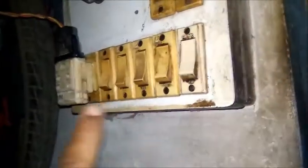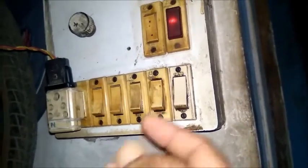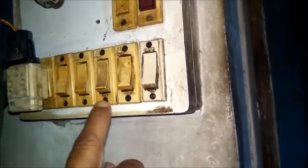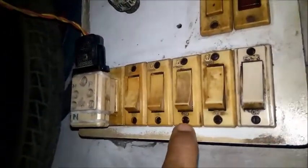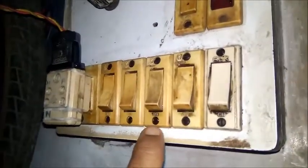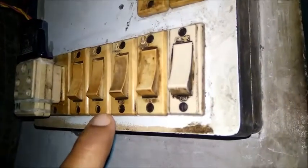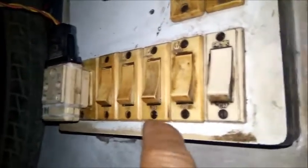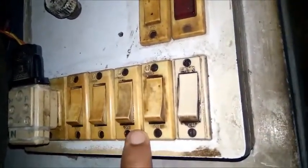You will have to be very careful to switch off power before you do anything like this. What I have told you is only about surface leaking — switches are leaking and may give a little bit of shock or electrical vibration on sensitive skin. But if these screws are giving you terrible shock, that means because of some electrical mistake or open wiring, a piece of wire is touching these screws. That is very dangerous. Get a qualified electrician to solve the problem — he will find where it is touching and properly dress the wire so it will not touch any screws and give you shock.